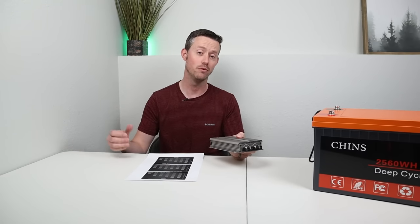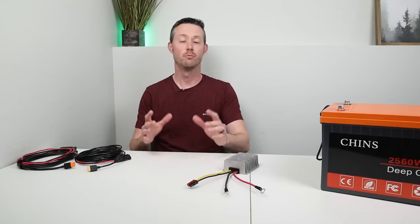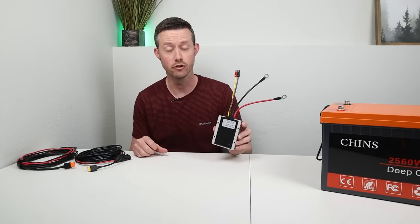Let's go ahead and test the final boost converter — the cheap small one. With the cheap $35 boost converter we saw 338 watts into the Delta II, 306 into the Delta Max, 258 into the P2001, 230 into the Anker 767, 196 on the AC200 Max, and 114 on the E2000. Pretty respectable results from this plain Jane cheap 12 to 24 volt boost converter — it puts out 24 volts under peak load, and most power stations are going to treat this like car charging.